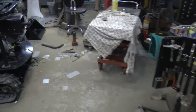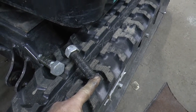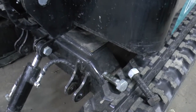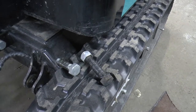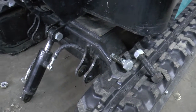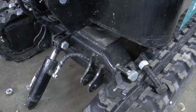When I took this off, I'll take you over and show you. It just has bolts going through with threads, and I don't think that's going to give it much wear. These threads are going to be chewing into the brackets and the cylinder. I'm debating whether to make some pins instead of just having a bolt in there, because you do move it up and down quite a bit and use it to stabilize yourself when you're digging, so it's probably going to wear pretty quick.